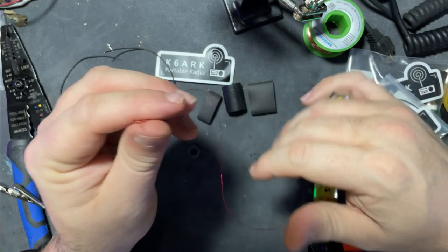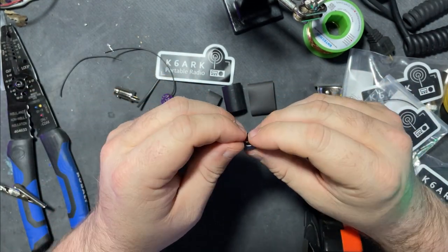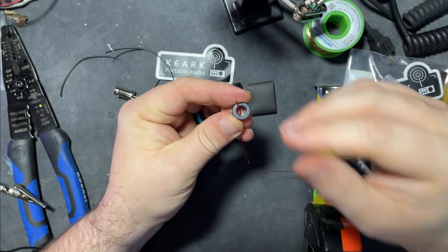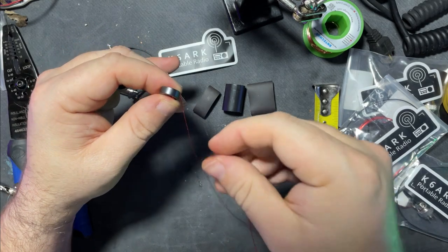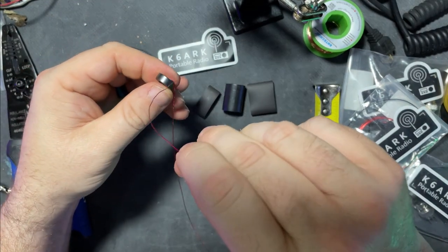So if I were to listen to Adam, he does have an instructional video. I'll post it in the card up at the top to link it to you. Also it will be in the description. You want to take this twisted part about halfway up in the middle of the toroid and then begin to do your turn. All right. Now we need a total of 21 turns. There is 3.